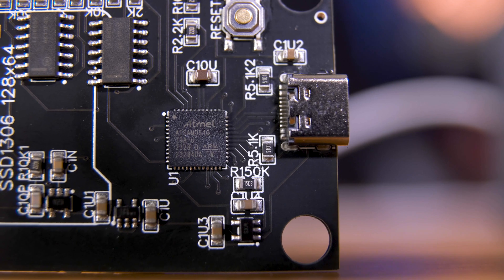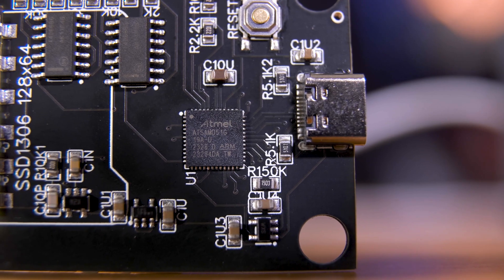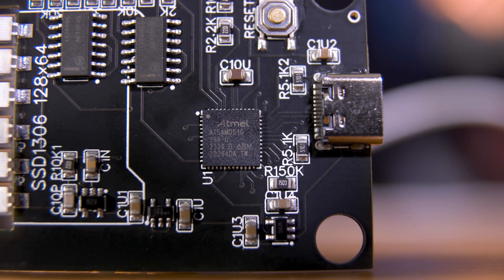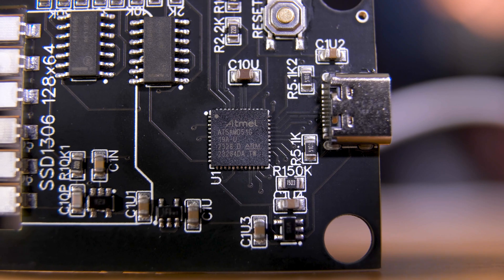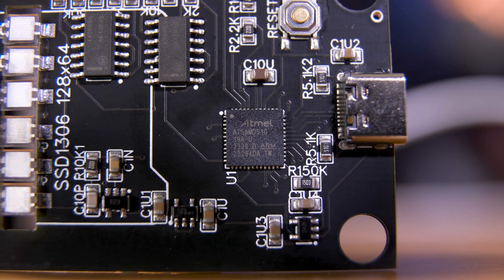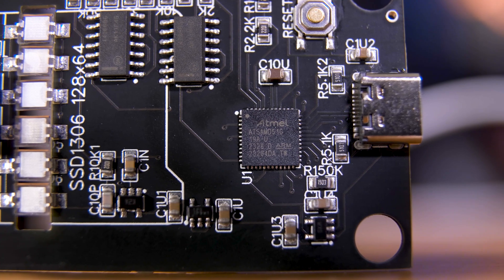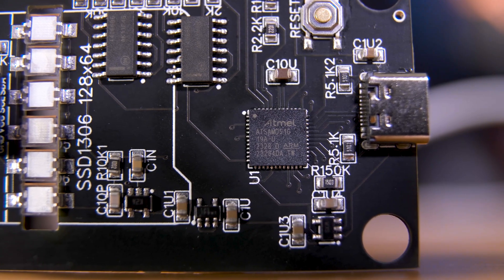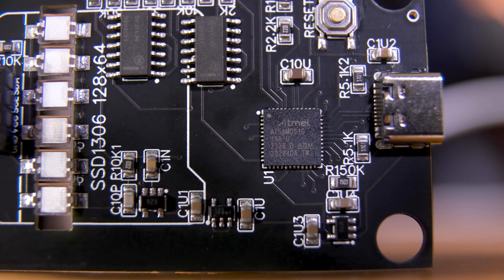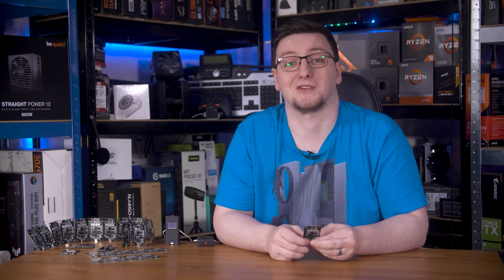So I did the professional thing and built the microcontroller onto my board. I followed Adafruit's schematic and wired it up as they have it, and that's important because one of the key things about the SAM D51 — the chip that both I and Adafruit use — is that it requires what's called a bootloader. A bootloader is kind of like the BIOS, or maybe even the operating system the chip runs with. It sets up configurable pins, clocks, and internal registers, and provides the instructions that then let you run whatever user-space program you install. In my case, that's the OSRTT code.